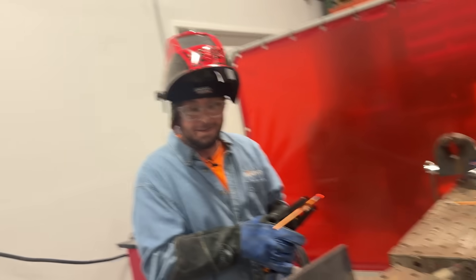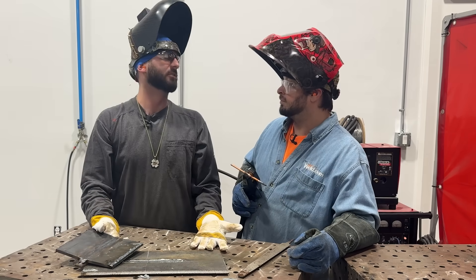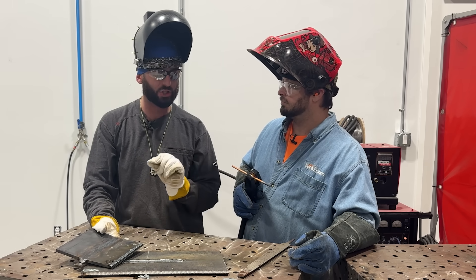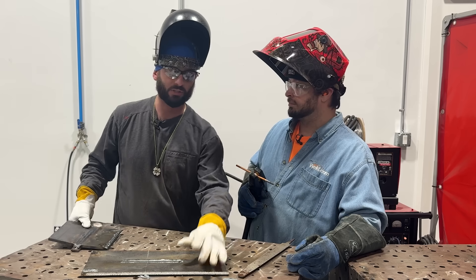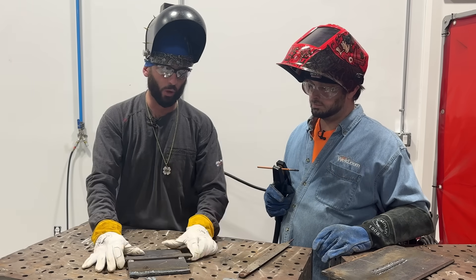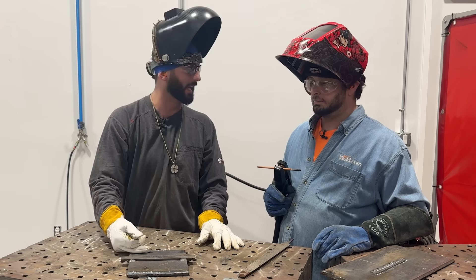I went deep, yeah — but you can see that line though. You can see that line clear as day — that's what you're looking for while you're gouging. Very nice. So now you know what it looks like to remove metal. We took a weld out of a fillet weld, specifically looking for that line of lack of fusion. As soon as you find it, you don't dig anymore. You've got to think about where it's located before you get to digging, because all that mess on the parent metal can get you into serious trouble or cost you a lot more time.